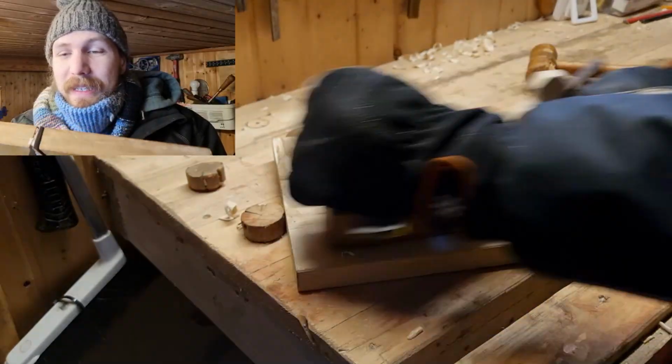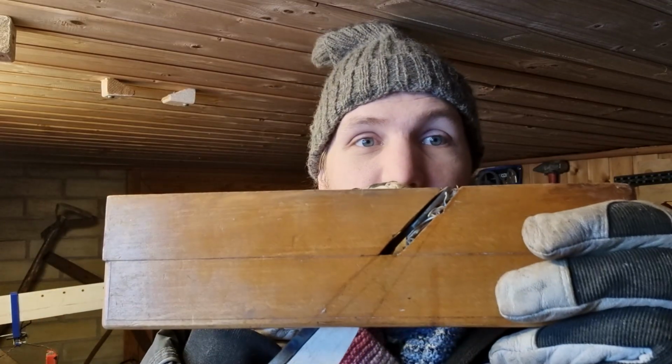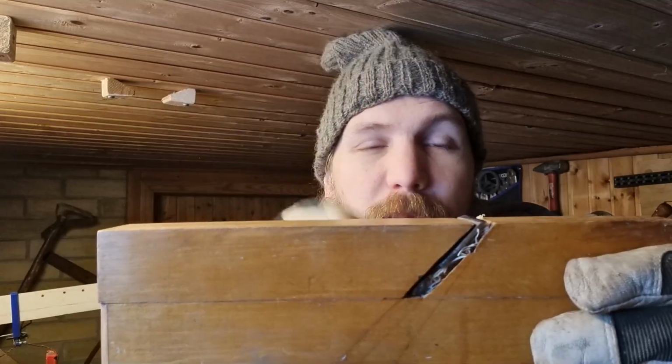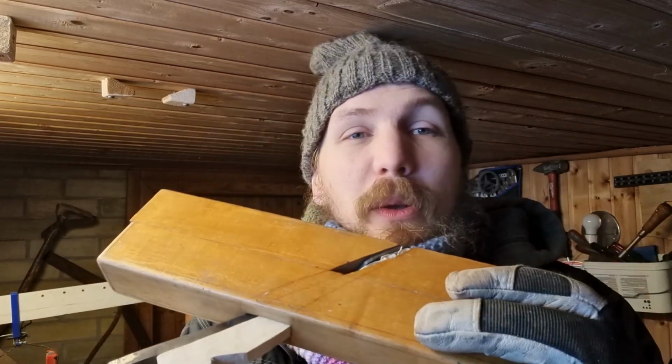I can play with it, but looking at it and working with it, I can see several mistakes in my design and my work. The first thing is that the backside of my blade is not actually touching the support, which means when I'm playing with it, it has some ability to flex, wiggle the wedge out. I should have researched better what faces were important.